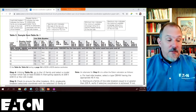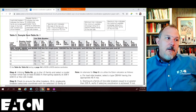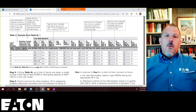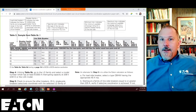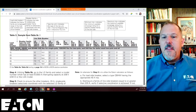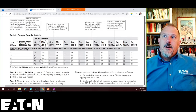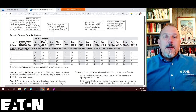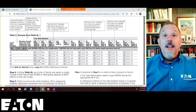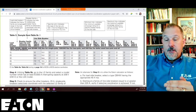the BAB20 downstream of an F-150, and I had this discussion with an engineer, a healthcare engineer, and I asked him, what kind of fault current would you expect to see at, say, a 150 amp panel board inside your power distribution system? He says, oh, we could see something as low as 5,000 amps or 4,000 amps. I said, okay, let's say 4,000 amps. He says, yeah, and it'll probably be higher than that, but 4,000 amps as a low ballpark figure, based upon where it's at in the power distribution system, at a 150 amp panel. Although they buy 10K breakers, in some cases they buy 22K breakers because the interrupting ratings are higher. But let's just go with 4,000 amps at a 150 amp panel board, with an F-150 as a main and a BAB20 as a downstream.